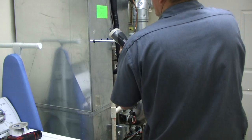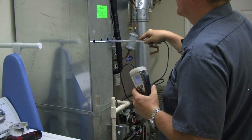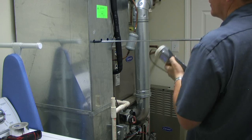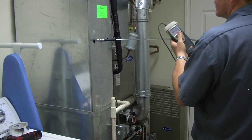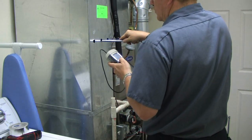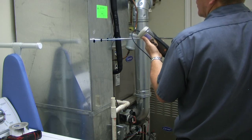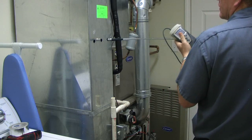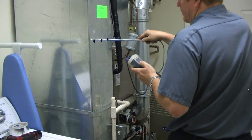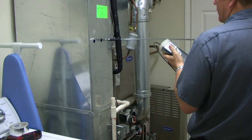Let's do this. I'm going to stick it in all the way to the back, push the hold button to start the timer, and slowly pull it out — make sure to keep it level and don't twist it, you want that fan tip unobstructed. There's a little silver tip right there — you want to pull it to the end, then stop and move it over to the next hole. Insert all the way in, start the timer again, pull slowly to the end, and stop it. We're done with all three holes.